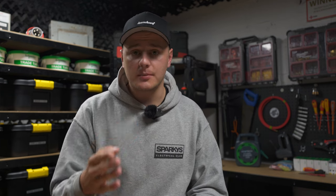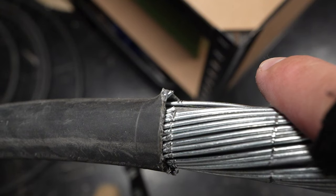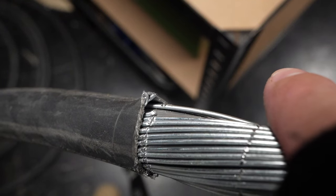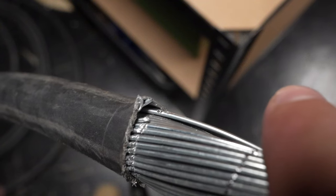Hockey sticks is where the steel wire eventually pings off but hooks over. That really affects the glanding process — in fact it makes it almost impossible. So if this does happen, you can flatten it with a pair of grips or a rubber mallet. If you continue without sorting these out, it's just going to cause you problems — you're not going to get the gland on.